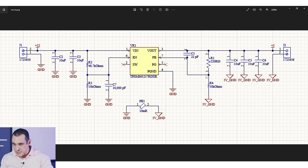In this circuit, we've only bridged the two grounds at DC, but we haven't bridged them at AC. So any AC noise on the secondary side of this regulator circuit is going to be more likely to radiate than to couple back to the primary side and return to the power return. You basically create a situation where the primary side ground and the secondary side ground can oscillate with respect to each other, generating a lot of noise emission. This is terrible for EMI and EMC.